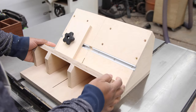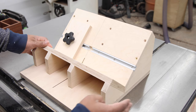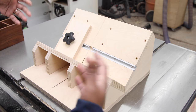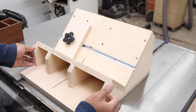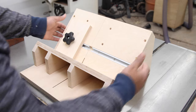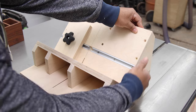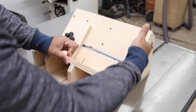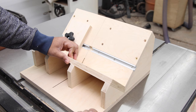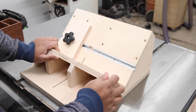So this is my take on a table saw miter spline jig. What you have here is four support pieces on each end that are essentially triangles — smaller 45-45-90 triangles in here, bigger ones on the back — and these two create essentially a 90-degree V-shaped support for the middle section. The middle section is screwed down onto all of the support pieces, and there are screws from the bottom coming up to the support pieces as well, giving us plenty of strength.